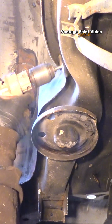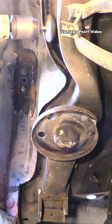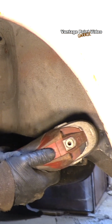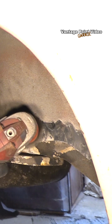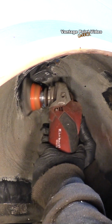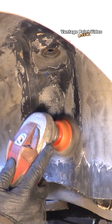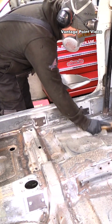There's actually 3 pieces of metal joining along that edge of the arch. So you've got this serpentine rear chassis arm, and then that has a tab that folds horizontal, and the floor meets on top of that, and the arch comes down beside them, the both. So the chassis member's tab actually bends down and meets the bottom of the arch, and then the floor sits on top, and there's a bit of a gap in some places between the floor and the arch, so I'll try and broaden out my welds to join the 3 pieces together, cleaning off as much of the paint and sealant around where the welds are going to be, just to reduce the amount of burning.